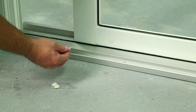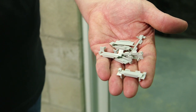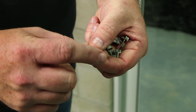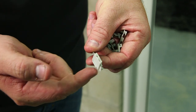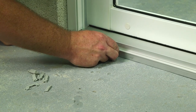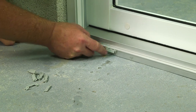The final step is to insert our weep hole covers. These are the weep hole covers. Sometimes you might need to assemble them. When you push them in, ensure that the flap is facing downward. Just press into the side of the weep hole, and then your weep hole cover will snap in.